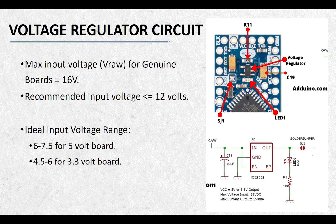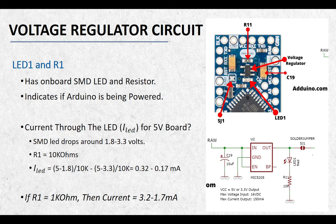For powering a 3.3V board, 4.5 to 6V is a sweet spot. And for 5V Arduino boards, 6 to 7.5V of input voltage is a nice choice. This is because the voltage drop across the regulator will be small and less power will be dissipated. There is an LED connected at the output of the voltage regulator, which is used to indicate if the Arduino is being powered, and the 10kΩ resistor R1 is used to limit the current through the LED.